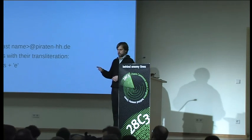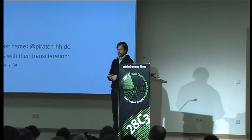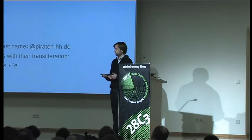That's one Schalter? Switch. One switch away. And one part of electronics that does the synchronization. You have the official net that goes with 50 hertz, and you have to synchronize it so that you don't disturb the net, and that does the machine. And everything else is just peanuts.